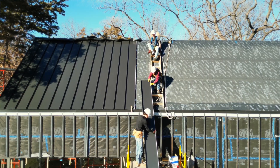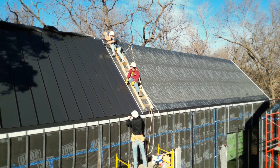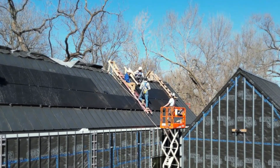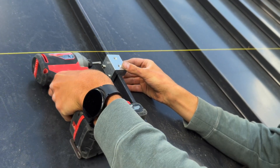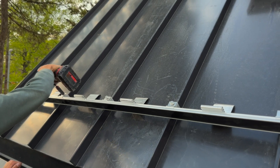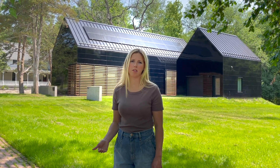We have been using S5 mounting systems for our solar since 2008. The standing seam we have found to be most cost effective because you don't have to have a secondary structure as you would on a flat roof to prop up your solar panels. So we cut down on costs by clipping it directly onto our standing seam roof, and using the S5 clips we've found that the longevity of that product really outlives the warranty of our roof. We're not voiding our warranty by drilling through the roofing structure, so we're able to maintain the integrity of our roof, which is really desirable from a homeowner's standpoint.